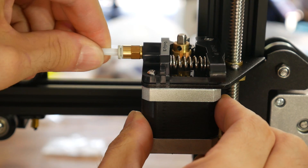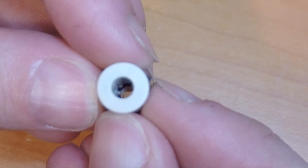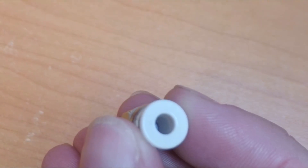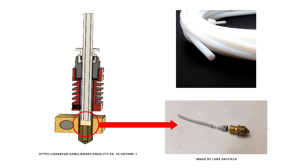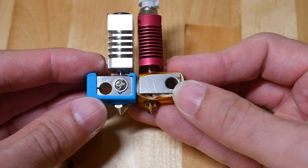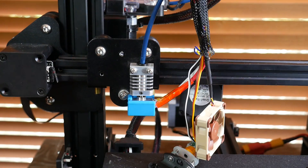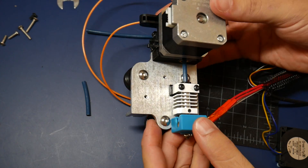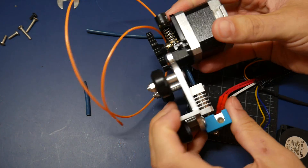Another failure point are the couplings used on the end of the PTFE tube. Early Ender 3 batches had a big problem with this, where the little teeth would break off inside the coupler. As they fail, the Bowden tube starts to slide back and forth during retractions. If the coupler on the hot end starts to fail, you're going to have a little gap which fills up with filament and causes clogs all the time. The all-metal hot end I fitted looks exactly the same, but there's one important difference: the tube only inserts to the very top and nowhere near the melt zone, which drastically reduces the chances of clogs — especially with mine mounted in direct drive, as the required tube is very short and in a straight line.